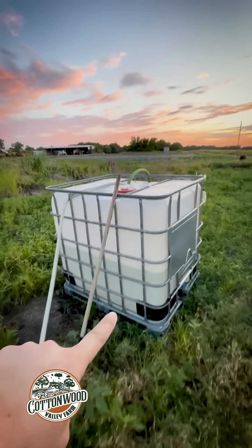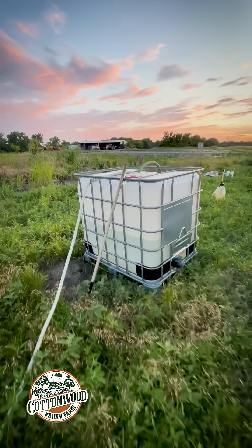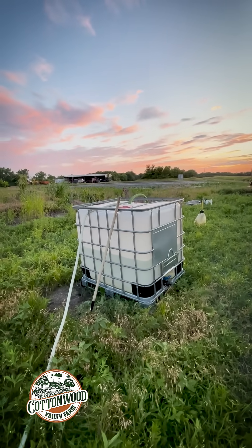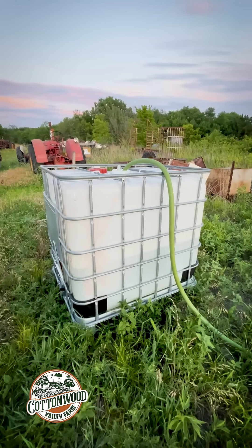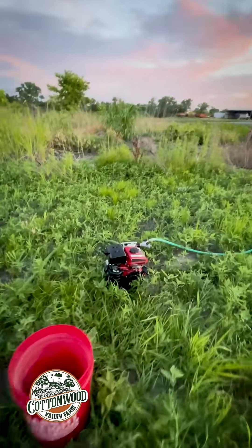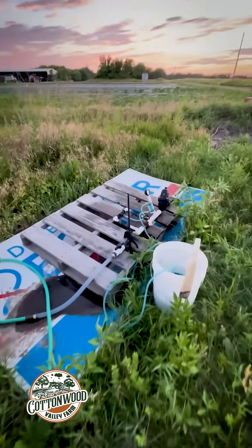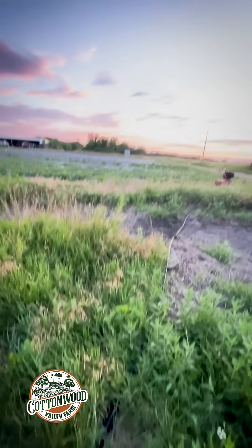Let me show you our pump setup and our tank setup. Right here, I have a 250-gallon IBC tote. This is one that some food-grade materials came in at one point — washed it out real good. What I have right here is a hose coming all the way back from our pump house. We have a great groundwater source out here, and we're very thankful for the quality of water that we have. The green hose is sucking out of this tank, so we actually are applying a little bit more than we're providing at the time. That's why we start with 250 gallons of water in the tank before we ever start the gas pump up. The gas pump we're using is a $200 Harbor Freight Predator 1-inch pump. It comes in right here, I tee off right here — you can see where I have the water — and it runs right over here to the injector where I just walked you through all those pieces. From here, we filter it, have a pressure regulator just to make sure we don't blow the drip tape up, and it runs through one-inch orchard tubing out to our field.